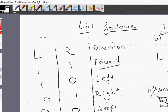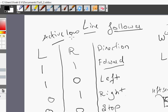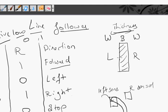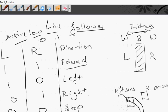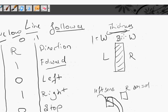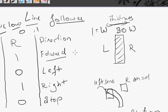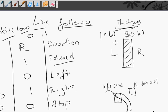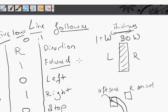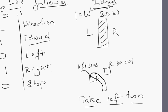These sensors work on active low, meaning when it detects something it outputs a zero, and when it doesn't detect it outputs a one. It detects black objects, so on a white object it outputs one. For simplicity: when the sensor is on white it outputs a one, when it's on the black line it outputs a zero. So both sensors on the white line gives one and one, meaning the robot must move forward - there is no obstacle, it will stay along the line.